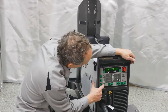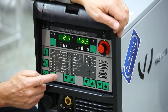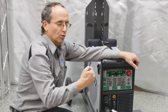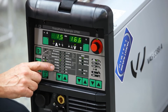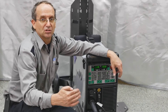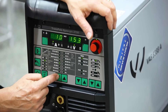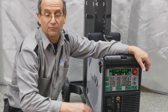On our scale over here, we hit diameter of the wire and select it to 1.2. For type of wire, your choices are steel wire, aluminum wire, copper-based wire for MIG brazing, flux core wire, and stainless steel wire — so this machine will do a lot of different things. We are going to be on the aluminum setting. It gives us three choices: A1050, which we don't really use in this industry; 5356; or 4043. The 4043 represents 4000 series parameters and the 5356 represents 5000 series. Audi uses a 4000 series, so we keep it on 4043.